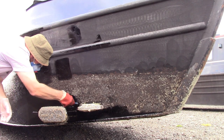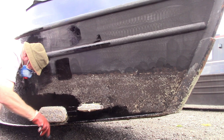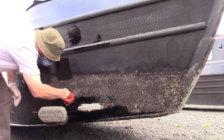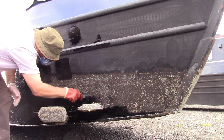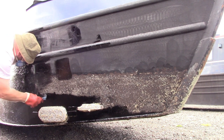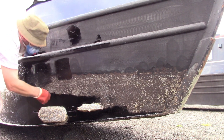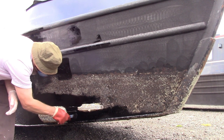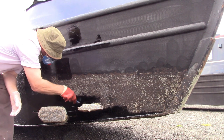In simple terms, sacrificial anodes prevent galvanic corrosion where two or more different metals are in contact with each other and water. Here you see one is severely corroded whilst the other is still in usable condition. The anodes tend to be made of zinc.